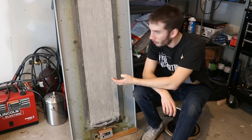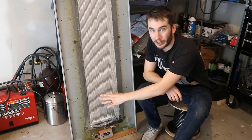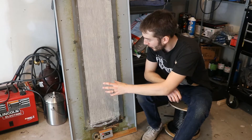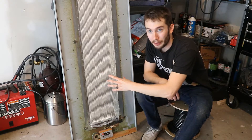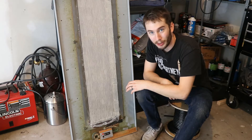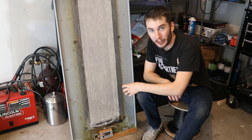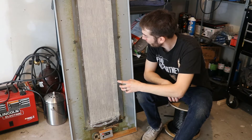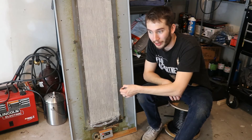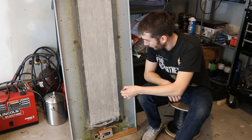It took me multiple, multiple hours to get to this point on this speaker. I actually laid this wire incorrectly after I had already glued it down, but the 3M Super 77 adhesive is forgiving enough to where I was actually able to shift the whole thing over one row. But I think that took about two and a half extra hours of very carefully moving it, trying not to rip the mylar, trying not to break the wire, adding adhesive as necessary. So I just want to give anybody who is about to attempt this a fair warning that it's going to be annoying, it's going to take a long time, it's going to be kind of tough. But the end result should be pretty good.